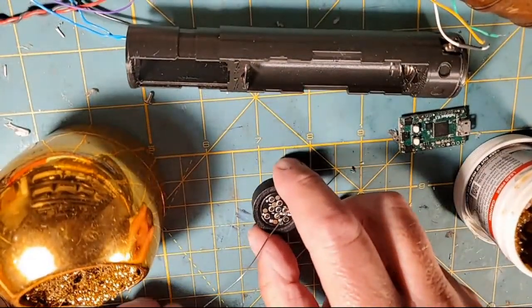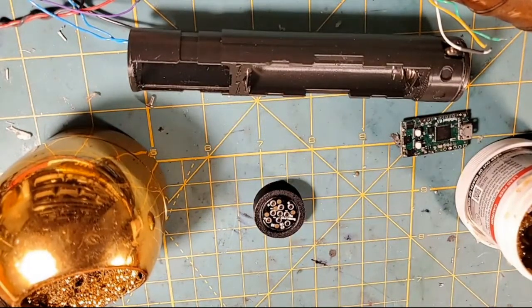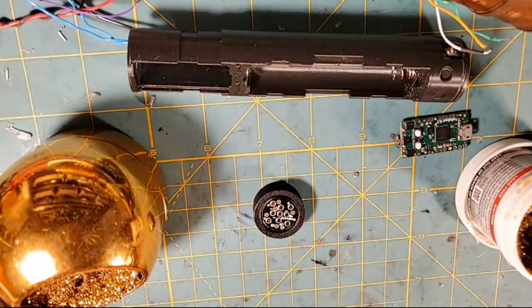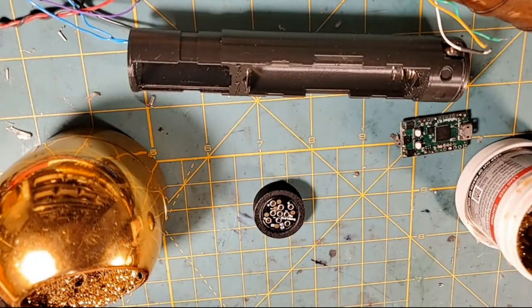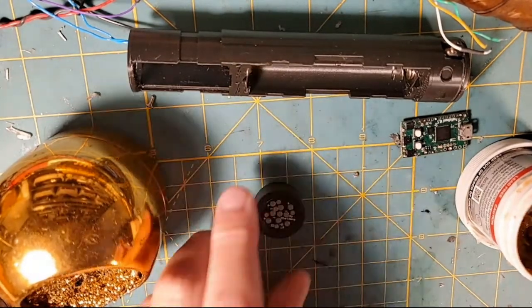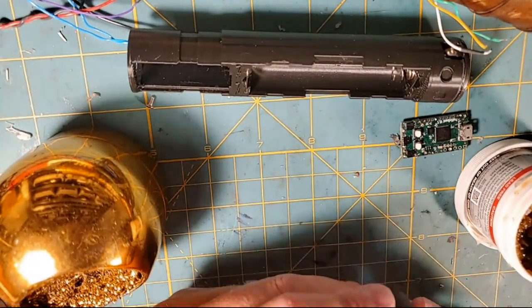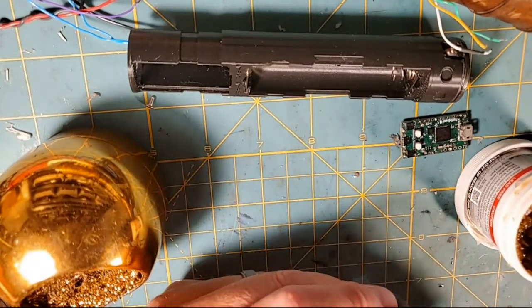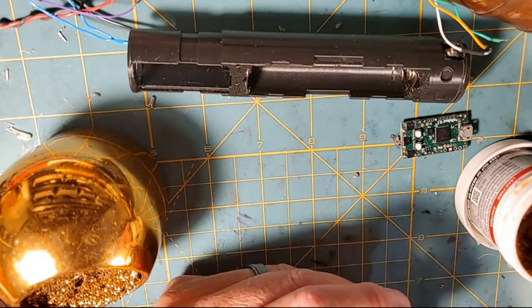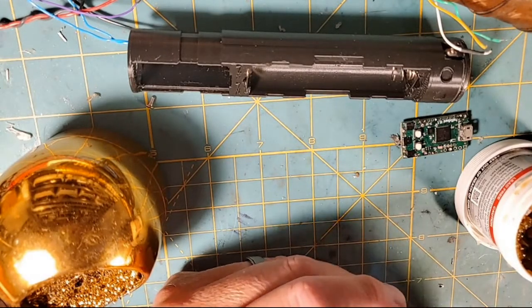Bring this thing where you guys can see it, and what we're going to do is use, let me find my little plastic thing. Where is my plastic nub? And I'm going to put a little bit of solder paste on the data pin on the D1. And I'm going to put a little on this positive out here. And then a little bit on negative right there.